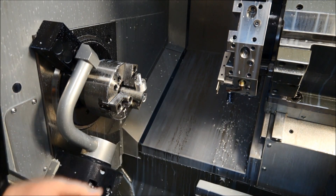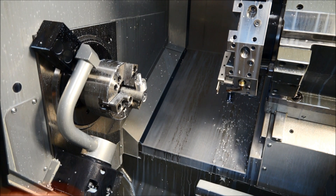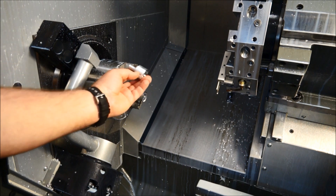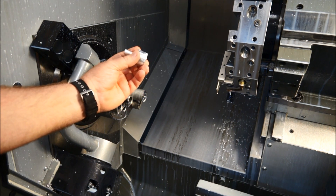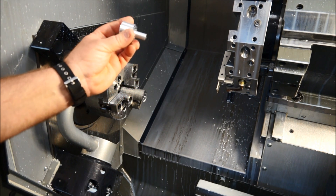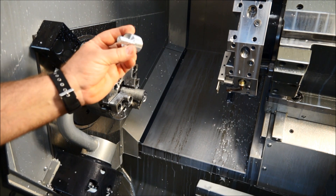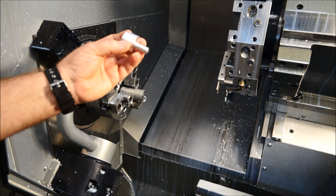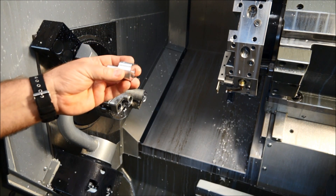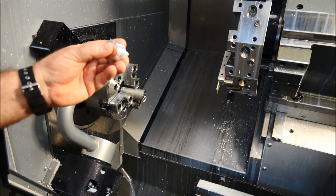Well there you have it guys. Sorry you couldn't see much with the coolant splashing everywhere — I probably should have had my GoPro inside the machine but I don't have a second mount. You can see what it made — it's quite simple. The cycle time on that was one minute 55 seconds. I understand you can speed that up, but this is a training machine. It's very important that you use the correct material — on this job we use free-machining aluminium and you can see it leaves a nice beautiful chip. Thanks for watching, I hope you learned something today — tune in next time, thank you.